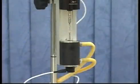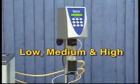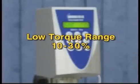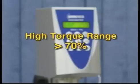The 13R chamber we are using supports a temperature probe allowing for temperature monitoring at the instrument. Based on the spindle you will be using, select three speeds that will give you a low, medium, and high torque value. The minimum torque value for a good reading is 10 percent. A low torque range would be 10 to 30 percent, a medium range 30 to 70 percent, and a high torque range above 70 percent.